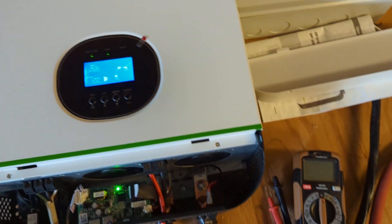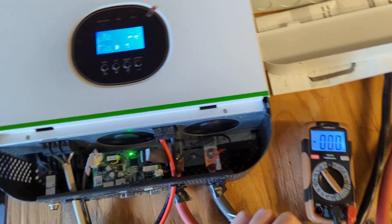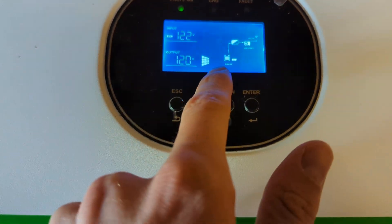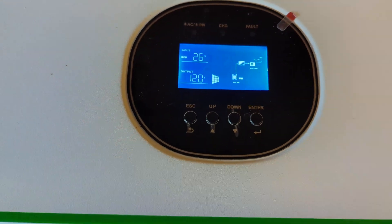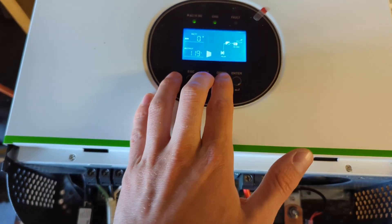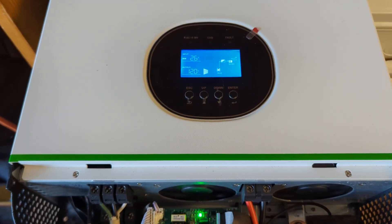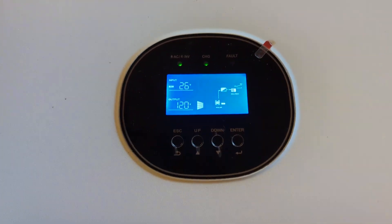Battery's 26.5. One interesting thing I did find — there's a click. PV-122, no line connecting, and then the relay clicks off and it drops back down. During the time when the relay comes on, it never seems to charge. That's watching my BMS app. When the voltage goes up on the PV, that's when the charging stops.